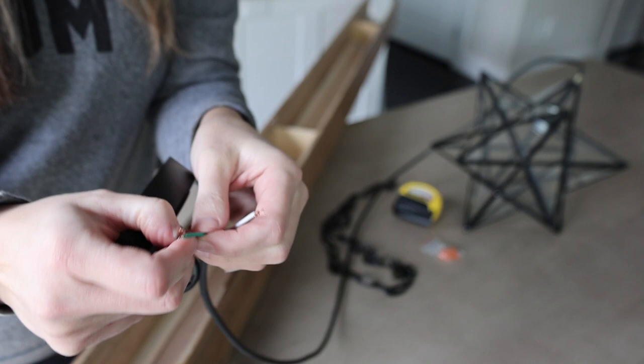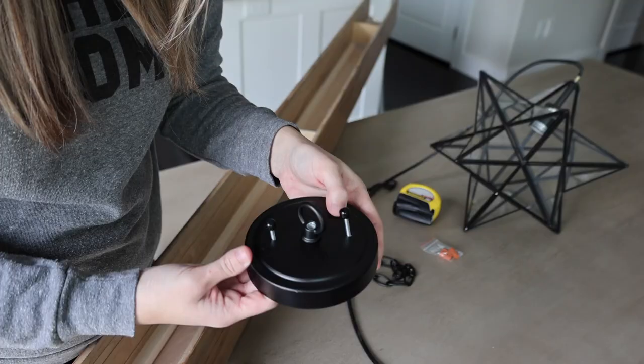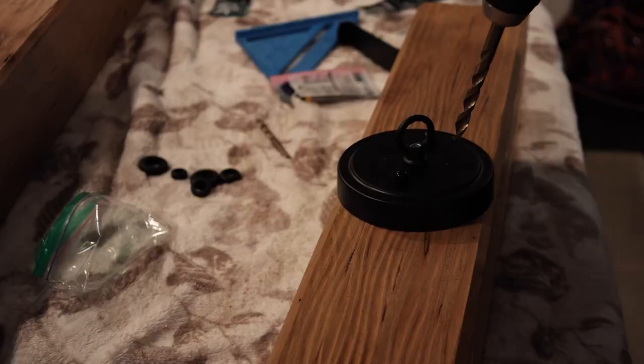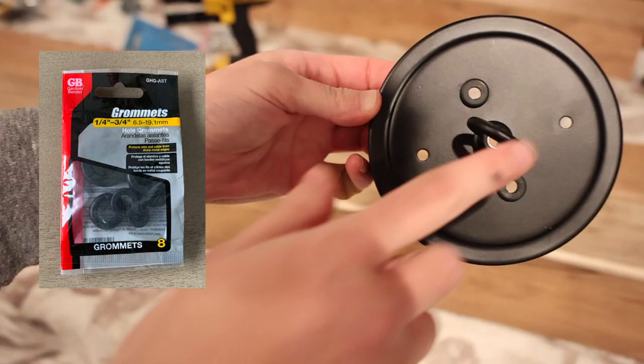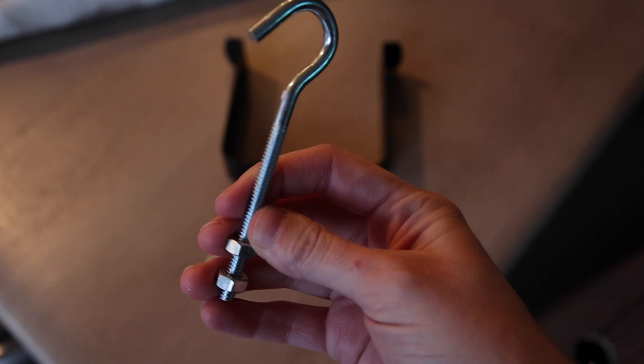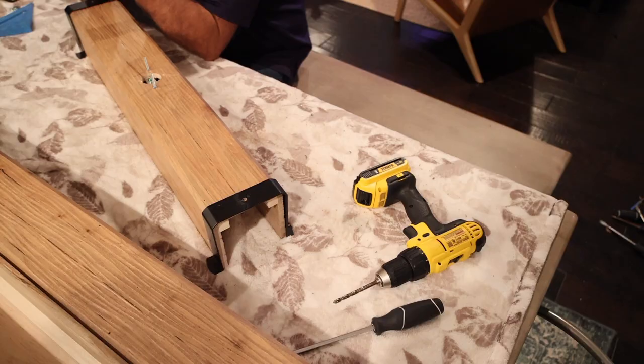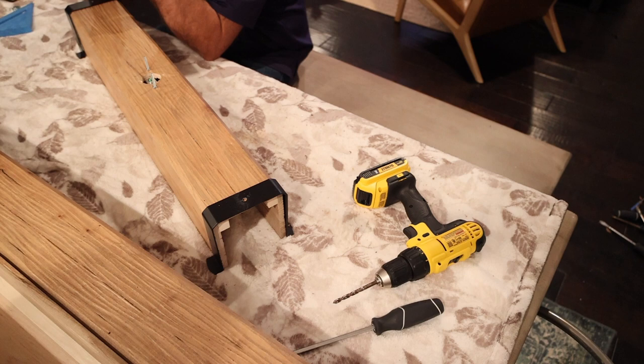Here's where it gets tricky. My plate cover had a hole that only allowed for three wires to come through. I'm going to be hanging two lights through one plate cover, so that means six wires. I drilled two new holes to allow space for all my wires. I picked up these rubber grommets at Home Depot and put them inside the holes I had drilled to give my wires extra protection and prevent them from shorting out. I drilled holes in my seam covers to put my eye bolts through. This is what I'll be using to hang the lights. I used eye bolts with nuts and secured one on either side of the beam. To make these look cohesive, I sprayed them with some matte black spray paint. I had some extra washers laying around and threw those in for some added support as well.